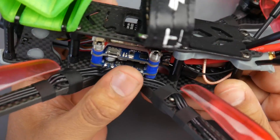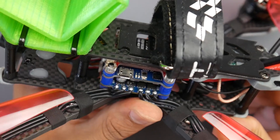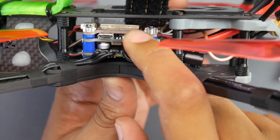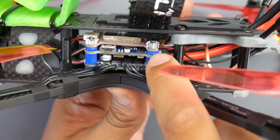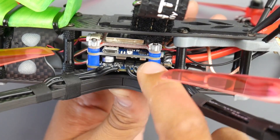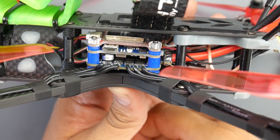For the flight controller they're using an F405 chip, which is an F4 microcontroller - absolutely phenomenal and you're not going to need anything more than that on such a build. The flight controller also has some dampening on it which I've never seen before. That really helps the gyro stay clean from vibrations coming from the frame.